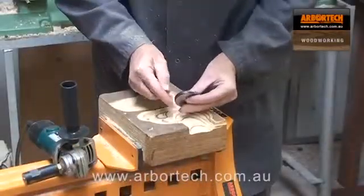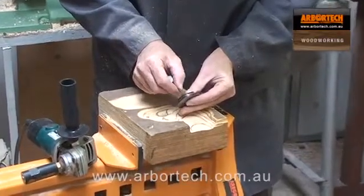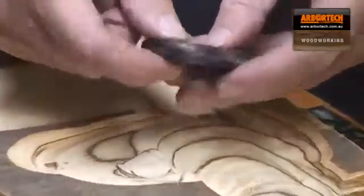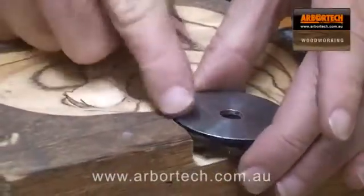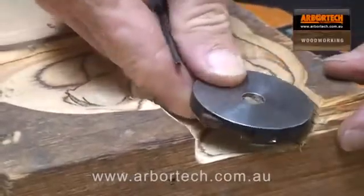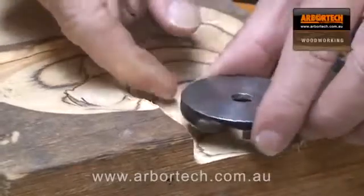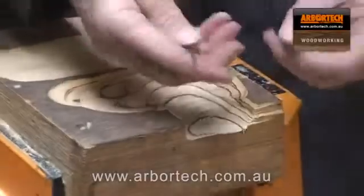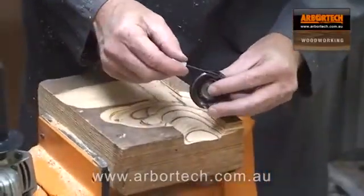So here I have a blade with a large build-up of resin on the side. You can see that it's not wearing nice and clean here. The resin is building up and preventing it from biting really nicely on its side. So with this particular blade, it won't cut down nice and square, but it will follow a path somewhat like this, where it'll be curving away from the surface, from the vertical surface. Now, to correct this, first of all, you should remove it from your machine. You get your Torx head key, and you must remove the teeth.